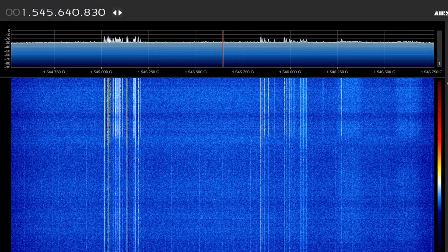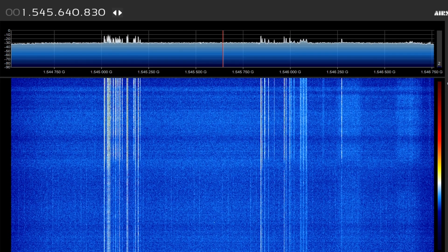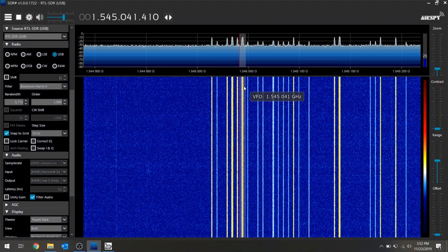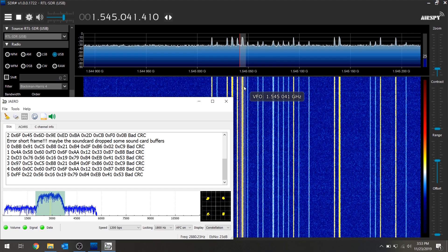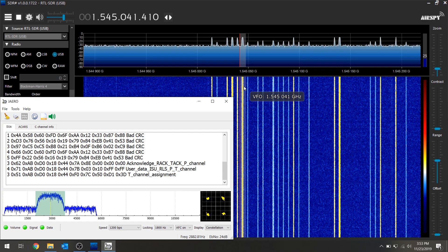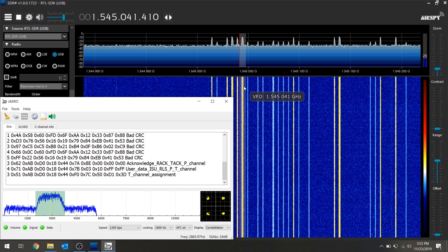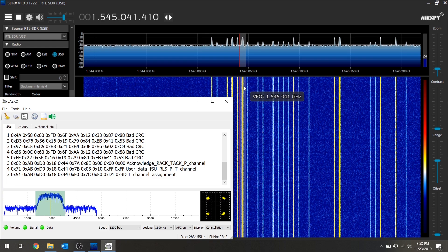As you can see, we have some pretty strong signals here. Let's open up Gqrx and see some of the things that can be decoded through the Inmarsat satellite service. While the Inmarsat Aero service may not necessarily have the strongest signals due to spot beams, these signals can be quite strong, and without a doubt we were able to get a very nice decode of all the typical 600 and 1200 bit per second channels within the Inmarsat service.